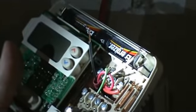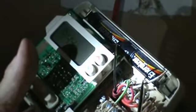Okay. Now, if you remember, the previous wire didn't have white. We had yellow, though. It had the black, and it had a yellow, right? The heating, yes. Okay. So, what are we going to do here? For this wire, are we going to say white to W and black to Y? Yep. Okay. We're going to go white here. The W is right there.